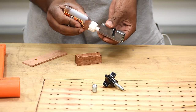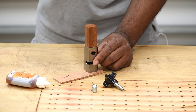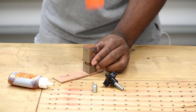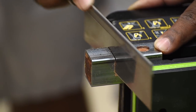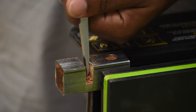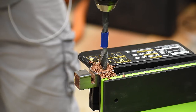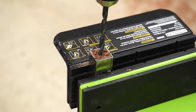I'm going to drive a piece of wood right into this tube, and to lock it in place I'm going to use some Gorilla Glue — this stuff is awesome, it actually swells up and creates a tight bond. Then I'll remove the wood from this section; the main reason for adding the wood was to have something for the threaded insert to grip on. I'll also drill out the hole that was previously drilled.